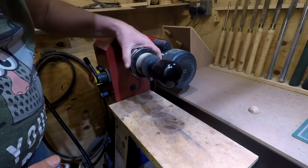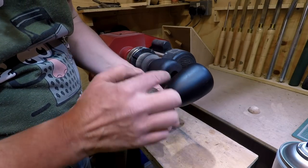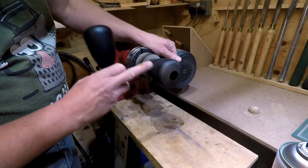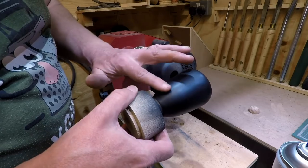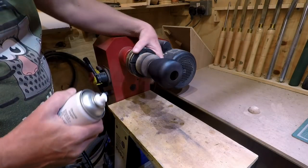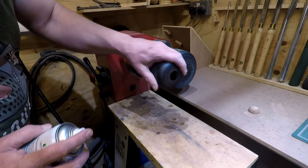The paint has already got a really good coat on it. The first observation is that the paint comes out a lot thicker and has given really good covering — I can still see the grain pattern through there. The ebonizing lacquer, which is touch dry now, is really rough and still hasn't even covered everything yet, where this has kept its smoothness. I'm going to give another coat of the ebonizer, a little bit thicker this time, and I'll do it with the lathe running as that seems to give a more even coating.